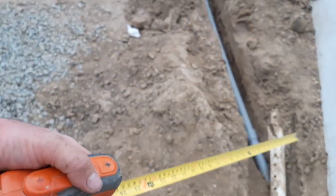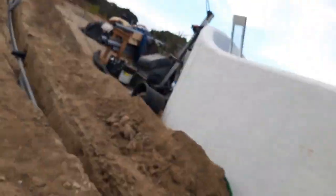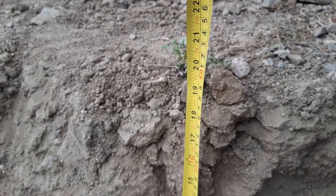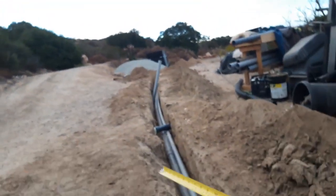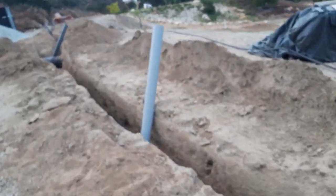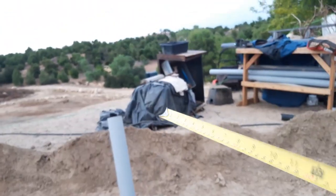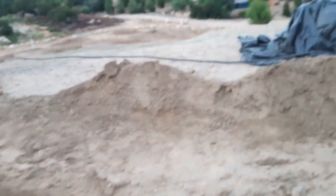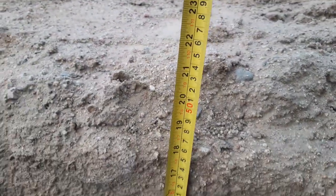It comes into these pipes. I got a little drainage pipe to fix so I can step on them. Going ahead and checking the depth here — 18 inches is the minimum, and a lot of this right here is right at 18, then 24 a little bit later. That little drainage pipe got fixed. We'll do some random test spots here. I'm going to use these conduits to drop down and measure the depth, since I can't move any vehicles through here. This one's more like 20.